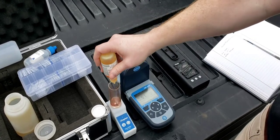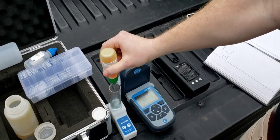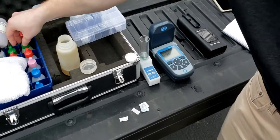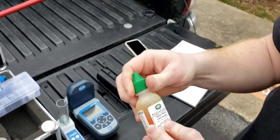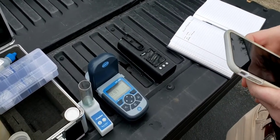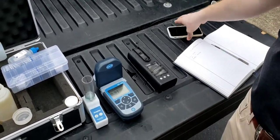Still goes back to orange, so one more — that'll be 16. So 16 minus 1 is 15. You always want to make sure you hold it directly vertical up and down while doing the drop, because that gives the full size drop. This is a one drop equals 50 ppm. So we got 15, and 15 times 50 — 10 times 50 equals 500, so we got 750 ppm of sodium nitrite in this loop.